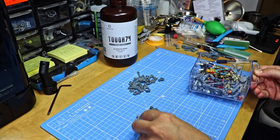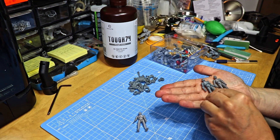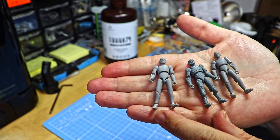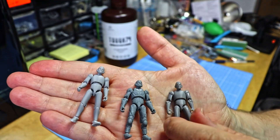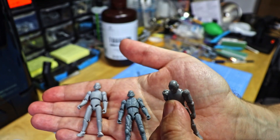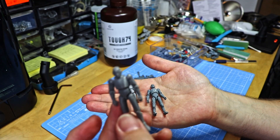I have a few comparisons here. This is M58, and I have a TH72 here. On the left hand side you see the M58 print — it's pretty light, but still not super translucent. You can also see on the joints it works well, but it has some dusting, so joints will over time lose some of their grip if you print only with TH72. But it still has a good grip — a little bit looser than the other two, but still working fine after a very long time. This print is about a year old.